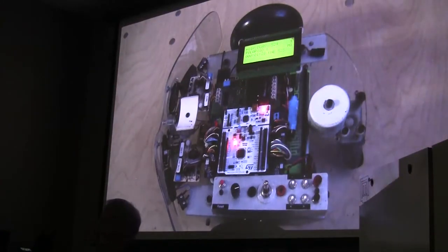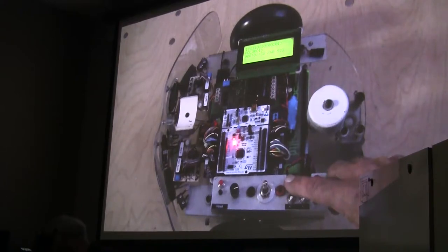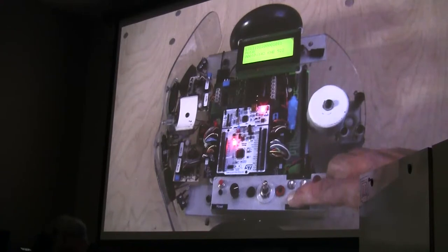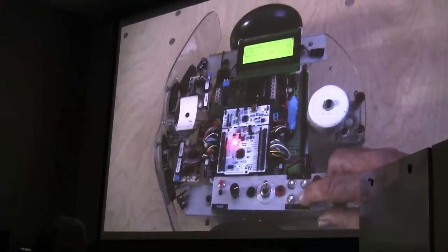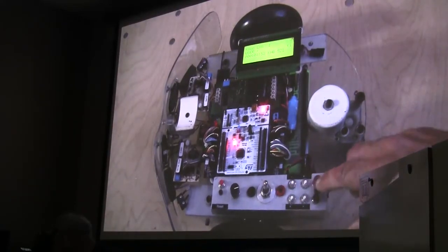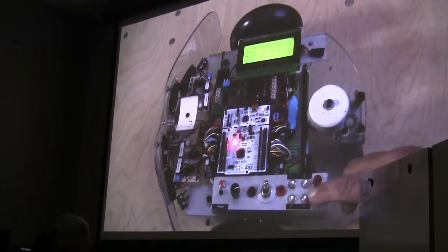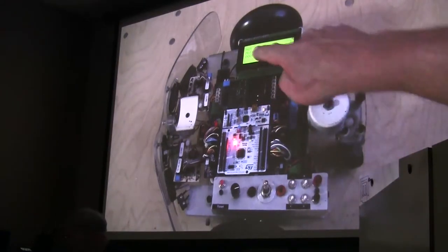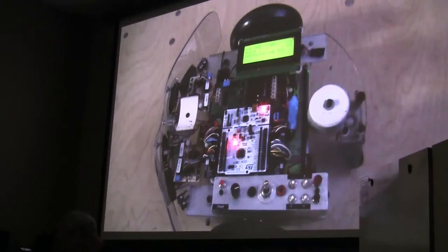There is another function where I can turn on, no, I'll just demonstrate. Go back down here to the user menu, and that's where I was setting the displays. And I'm going to say I want to enable a knob. This is an automatic function. And now if we go back up to, and we can just choose anything. I'll tell you what, we'll go into the motor controller. And the motor controller velocity is currently set to 300. So I could set it to something, like I could set it to 521.